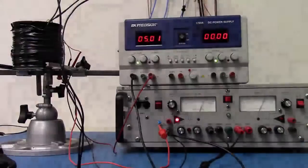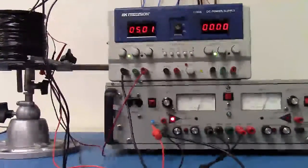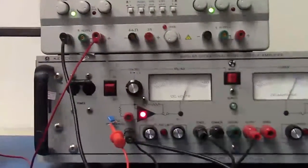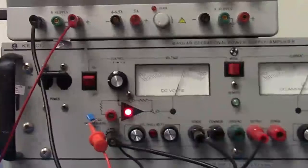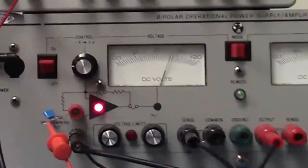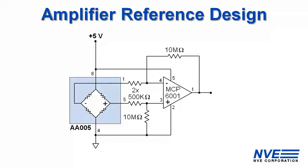The control circuit runs on 5 volts and a power operational amplifier drives the solenoid. We could just use a PWM controller for the power amplifier but we have a bunch of these in the lab. The control circuit uses a differential amplifier reference circuit for our Wheatstone Bridge analog sensors.